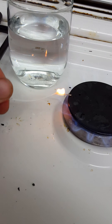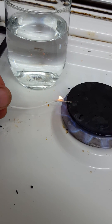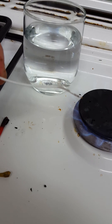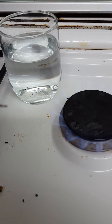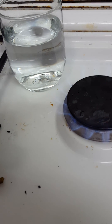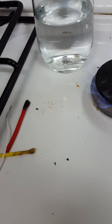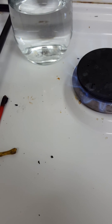It is extremely high temperature wire. This is the type of wire you'll find on lambda sensors — things exposed to the exhaust manifold. This particular one is silver-plated copper wire, so it's a little bit less resistive. It's pretty expensive stuff — about 50 pounds a spool. I hope you found this interesting, the differences in the three wire insulations. See you around.